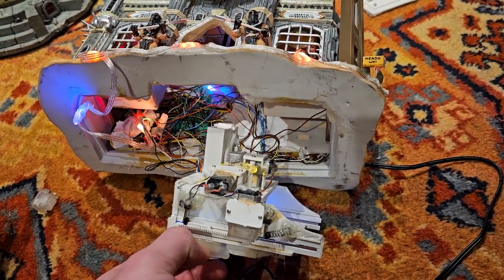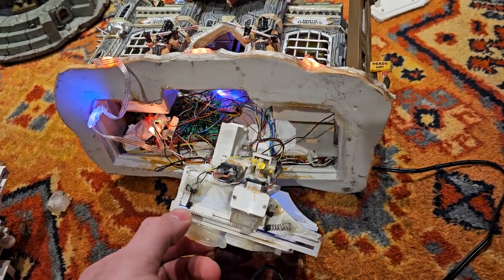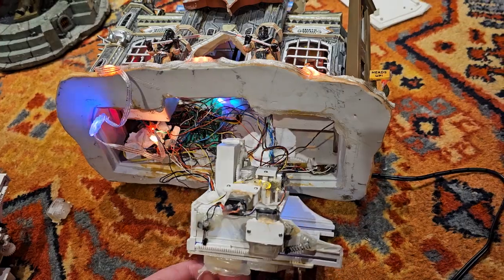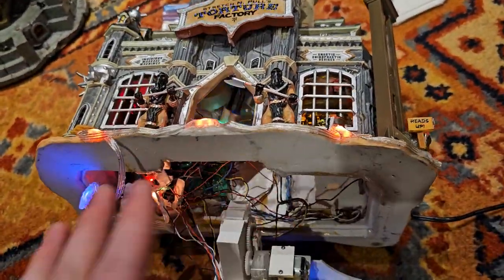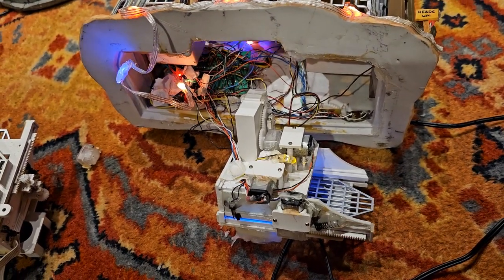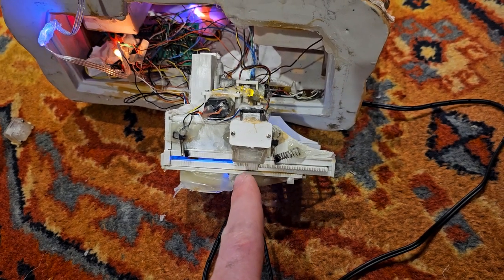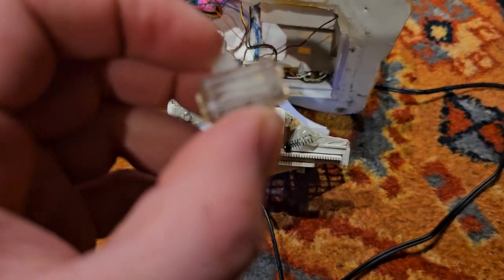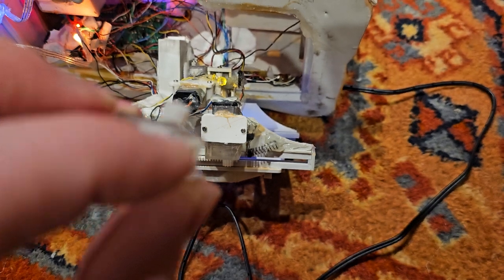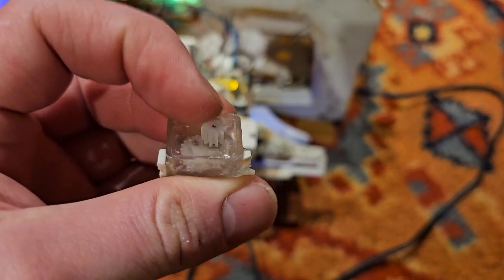Unfortunately, it's been in and out here now like 3 times, and each time there's something else that went on with it. Originally, it was just the hope that I could install my custom lighting system with it, and then we also did notice that the gate motor was clicking and there was a bad gear inside of this gearbox, and unfortunately it's the friction fit gear on the main output shaft, so the one that's actually linked to this main outer gear.